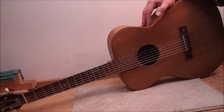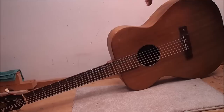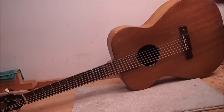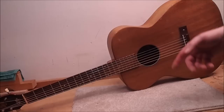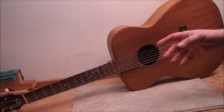What they really are is an excellent stepping stone for learning repair techniques — you can practice on this one before moving on to high-dollar collector's instruments. Where Martin relied on a highly skilled workforce making fewer guitars with a lot of hand-fitting, Harmony didn't have that luxury. They had workers under a lot of time pressure, so they relied on precise tooling — pop the neck off the assembly line into the body, no hour spent fitting. If you want to learn neck resets, these are very similar to Martin: similar dimensions, dovetails that fit predictably, and they're put together with hide glue.